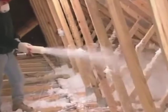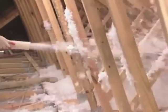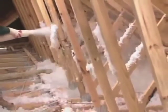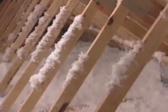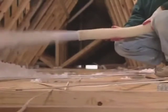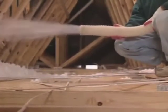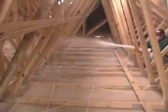Here's an easy way to waste insulation and leave the attic with too little R-value: this installer is hitting just about every truss and cross brace in the attic, which compresses the insulation — and compressed insulation loses R-value. He'll also need more bags to do the same job. Blow insulation in the clear, not against obstacles.